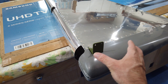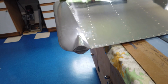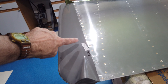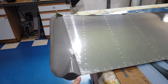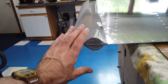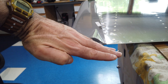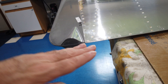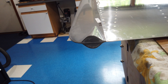The biggest thing I dealt with was the trailing edge. This piece was kind of cocked — both long edges fit nicely, but when I looked at this edge in relation to the trailing edge of the rudder, this piece was definitely cocked. As an example, if it was cocked this way, I'd have to take material off the entire length of that bottom edge to allow it to drop in line with the trailing edge. That took the most time.